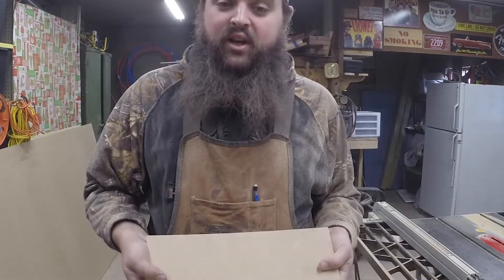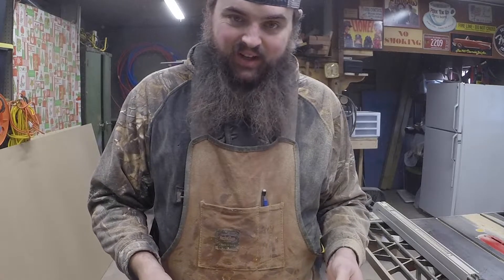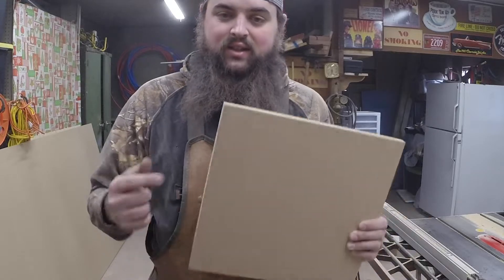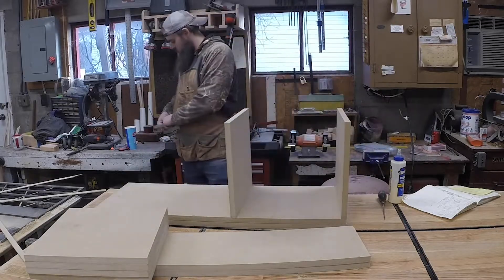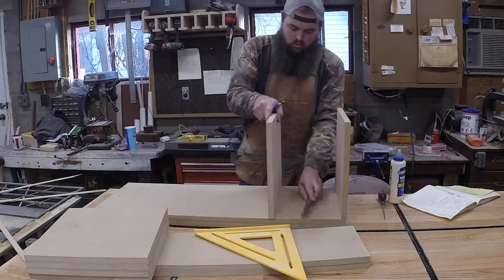It turns out I'm going to need a new crosscut sled — none of my edges were square, they weren't straight lines. So what I did instead of doing 14 inches across, I'd do 13 and three-quarters and rip it on my fence so that at least these two sides are parallel. Then I'm going to put all of my dividers in, mark out where those locations are, and drill out pilot holes and countersink from the bottom, just to glue and screw them all together.